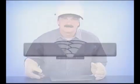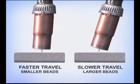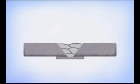After the first pass, run as many beads as it takes to fill and cap slightly wider than the bevel and above flush with the surface. On heavier metal, plan the weld, using the travel speed and gun angle to control the amount of weld deposit. Fill slightly below flush, leaving the top corners of the bevel as a guide for the final passes.